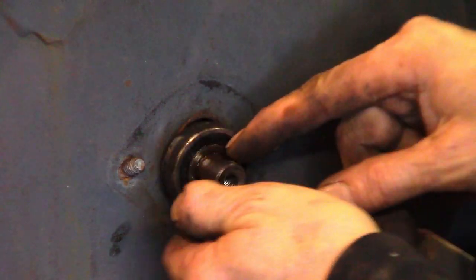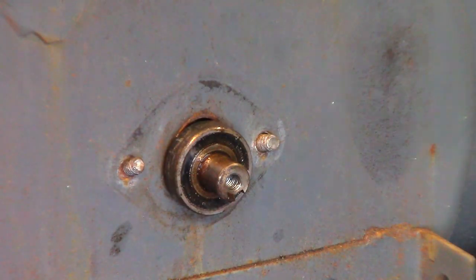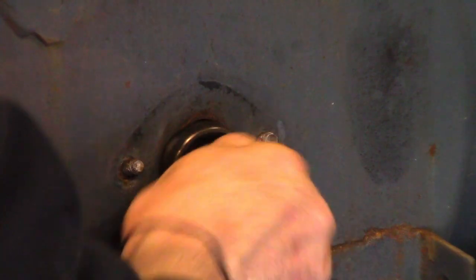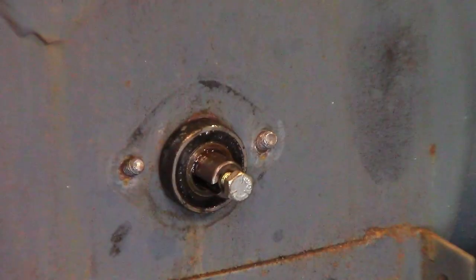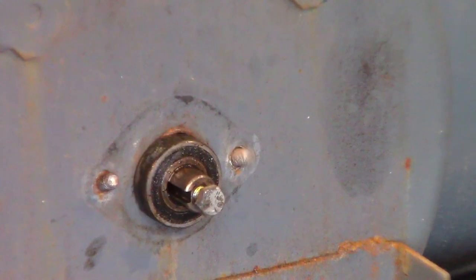It's got penetrating oil on it. I'm going to see if I can just gently tap the shaft out and leave the bearing sitting where it is with a rubber mallet so as not to harm the end. I'll put a standard coarse thread 5/16ths bolt in it - it's probably going to be too long, but we're going to try it and whack it. It's moving - slow, but it's moving. More penetrating oil in there - spray everything.